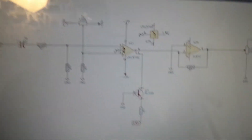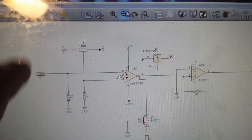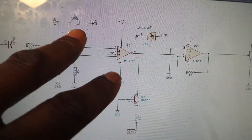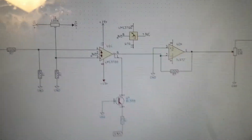So for instance, when you trigger the envelope generator, you can get a bump coming through as a voltage. What we do is null that out by centering the trimmer. I think we'll probably get about half voltage there, so we null that out to about seven and a half volts, if that works out as a voltage divider — somebody correct me on that if possible.